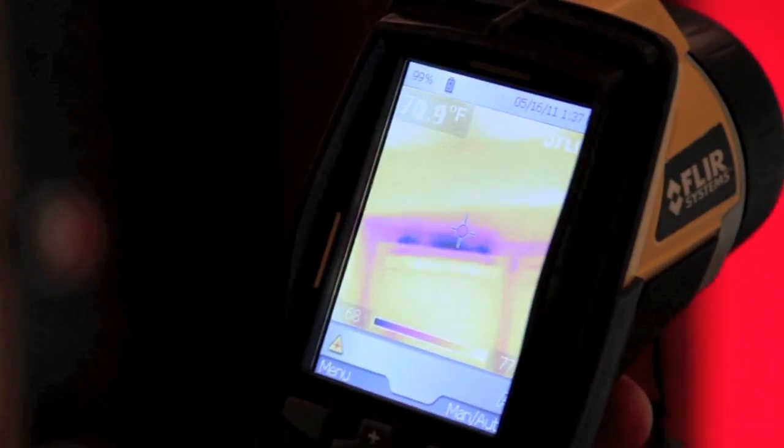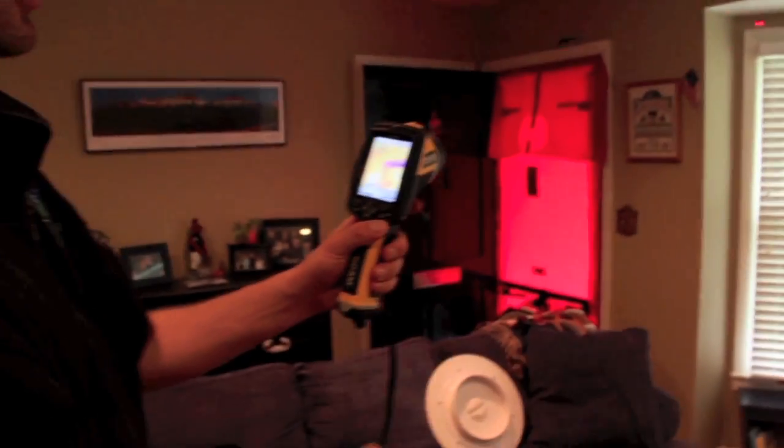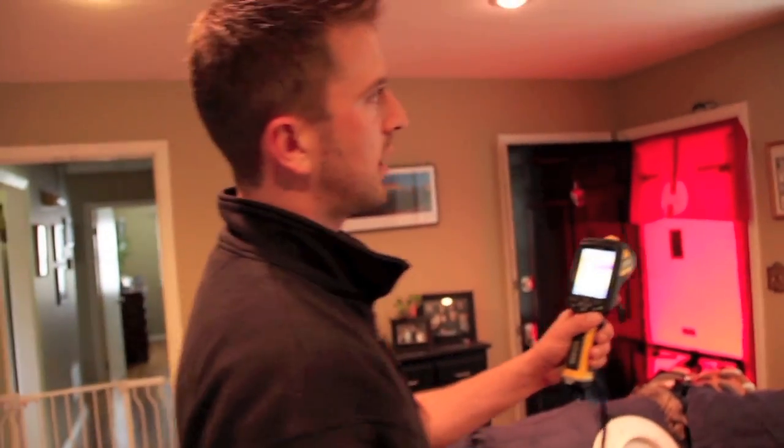You can see right across this window a lot of cold air that's actually leaking in from the outside around the window trim. There are two ways to handle that: you can either take the window trim off and fill the gap between the window and the framing with expandable foam or caulk, or you can simply caulk the trim to the drywall.